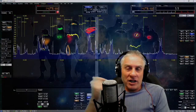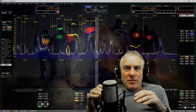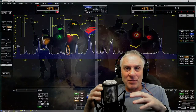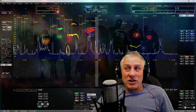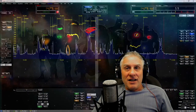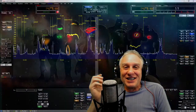So it's up. But the problem is I used, I think it's a quarter inch or 3/8 inch cutting board, right? I painted it black, and when it was really hot, the sun got it because of the black paint. You should see it, the cutting board, and it's light. I guarantee the entire antenna weighs no more than maybe 6 pounds. It's got 20, 17, 15, and 10 on there. And the cutting board literally warped, and it's all just hanging down. It melted the cutting board.